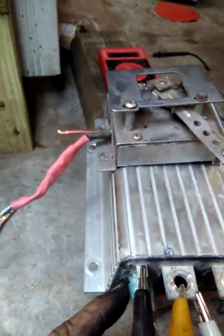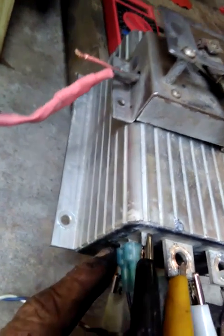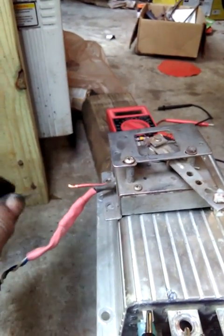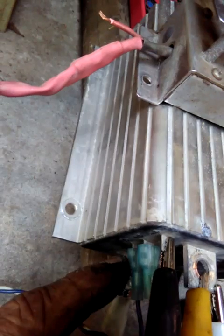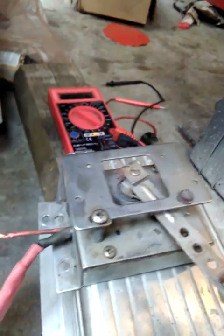The other thing is your potentiometer wants to go from 5k to 0 instead of 0 to 5k, which is the regular way. Basically what that means is that between these two pins, when it sees five volts it's going to be off, and when it sees zero volts it's going to be full on. The wiper on the potentiometer — the middle one goes here, the top one goes to plus, and the bottom one goes to minus.